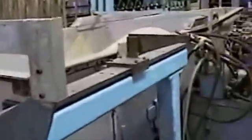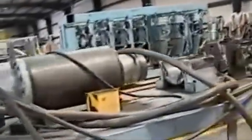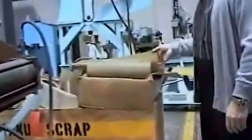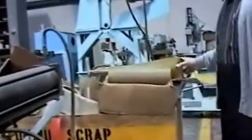Yeah. Here's another bond fixture for the four-place aircraft. One is in Hot Springs. They got two bond fixtures for the lower two places. Now this unit right here took a long time to make work, and the expander. For the spar, expand each spar. We use urethane, precisely machined plugs, and by experimentation I came up with the final numbers for the diameters and the length.